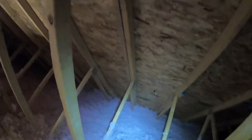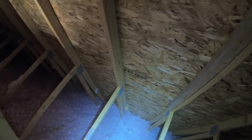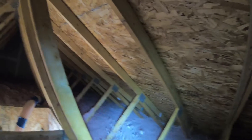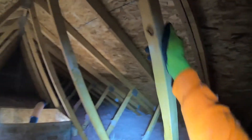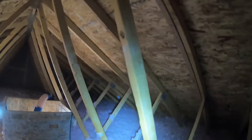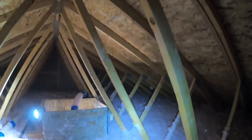I always keep your distance, just like that, so you're not using too many bags. This is a 700 square foot garage, and I'm gonna estimate it takes about 14 bags of the Pro Pink insulation to get that R40. About two bags for 100 square feet — that's what I sort of estimate usually. It's a good estimation.